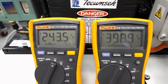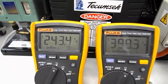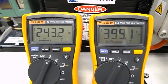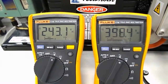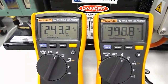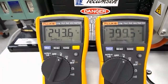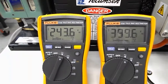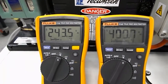So it's quite surprising for many people to find that you get 240-odd volts coming in and you get over 400 — usually around 400 — coming out to the relay. People, especially apprentices, don't often know that that's the effect of the back EMF or self-induction from the compressor. The faster it goes, the higher the voltage, and it's all really dependent on the amount of windings that it's cutting through as well.